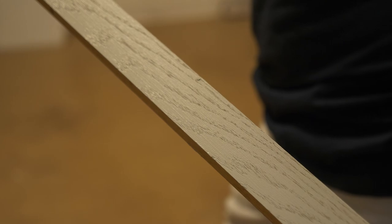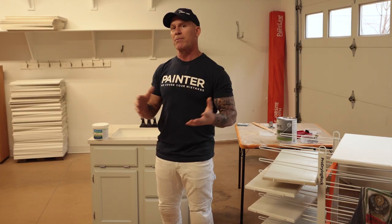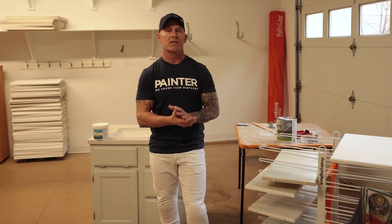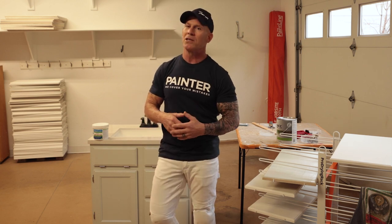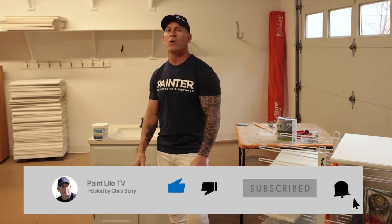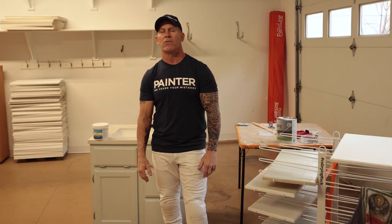Our laundry room is going to be shipped off and finished. This video was about the challenges of using aqua coat over a pre-primed surface — it's already white, so it's really difficult to see where you've applied or where to sand your aqua coat when it dries. The pre-prime surface here was a Kilz oil-based primer. Michael would probably apply aqua coat over the bare oak before any priming next time. If you've got any tips or tricks for applying aqua coat, leave them in the comments below, hit subscribe, hit the notification bell — see you next time right here on Paint Life TV.